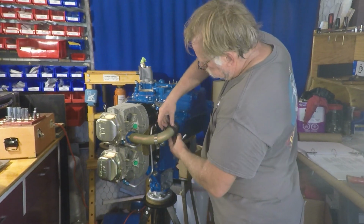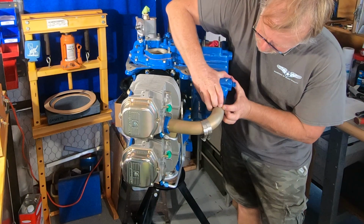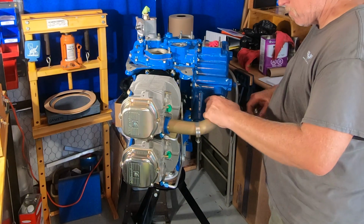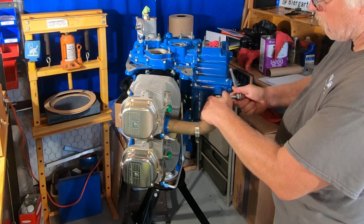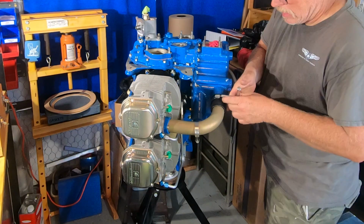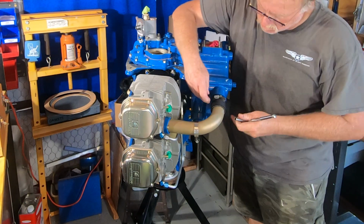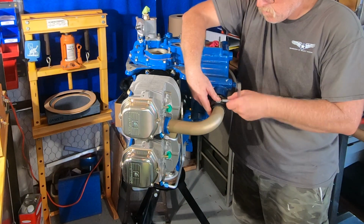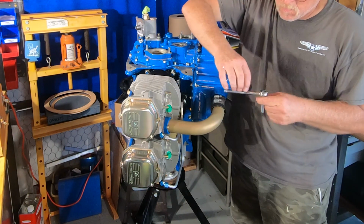And here now, I switch up my sockets, and since I tightened up that flange, I'm making sure that rubber connector hose is down, and then we'll tighten up those Jubilee clamps and make them nice and snug. Now you can see I'm orienting these so that, as the oil drain back tubes are up in a shelf area, we aim those where you can access them from the forward area, because we're assuming that's better access. There's less to do, there's no engine mount, things of that nature. On these, we're orienting them to the bottom, so we're getting those set. Now there's nothing hard and fast where they have to be.